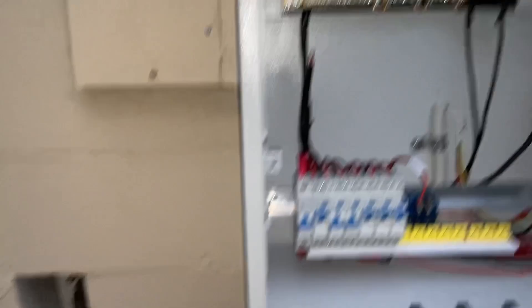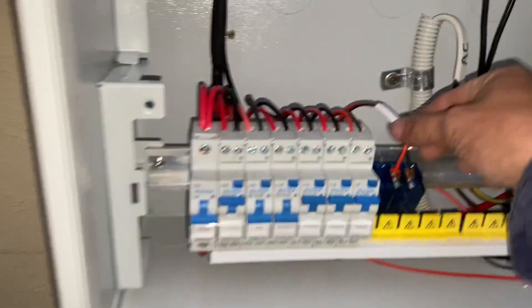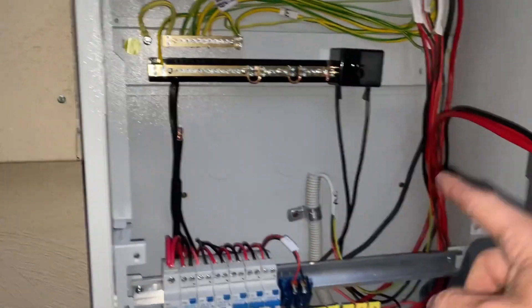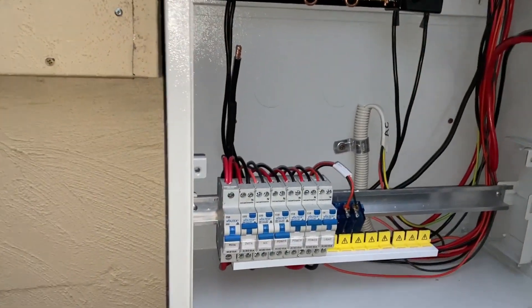Board's all done. Now a little conduit issue inside here — we've got to come back for that one. We're just about to do polarity here. This was a mystery circuit we found. We're going to do polarity and start measuring these circuits, do my earth continuity, and we're out of here.